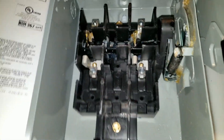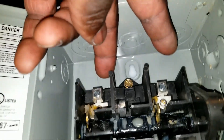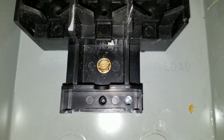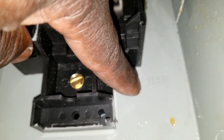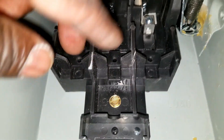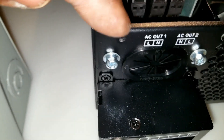This guy right here goes to this box — it's a nice box and it's non-fusible. The wire coming from the output goes into the line right here. You choose which side you want — the brown and the blue — to fit into. The output is gonna be here where it says 'load.' This one goes back to your house. Don't fit it in reverse — if the line is in here going to the house, you have a problem.